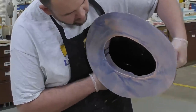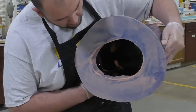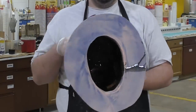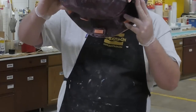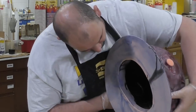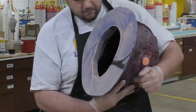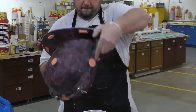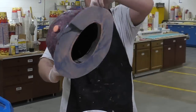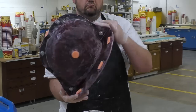Some important features of rotocasting hollow helmets like this: you can see into the mold, so you can clearly see where the material is applied. The key is making sure you get a layer of resin on all the interior surfaces to capture the detail. Continuously watch to ensure there's not too much resin and that everything is covered, then continue to spin the mold in a 360-degree pattern. If that mold were 20 pounds, this would be impossible — keeping support shells lightweight is the key to successful hand rotocasting.